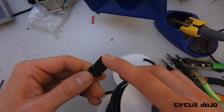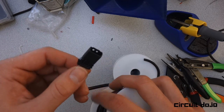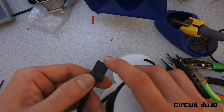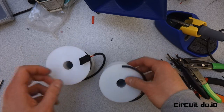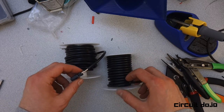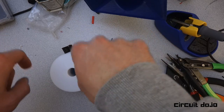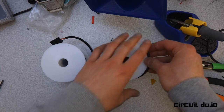This connector is a little more tricky than the other one, but the crimping process is the same — make sure the orientation is correct when putting the crimped ends in. I'm following the same pattern as before, terminating it to the coil of wire because these ends are going to go underneath the wiper motor cowling cover, while the rest of the wire runs into the engine compartment, down through the firewall, and back inside.